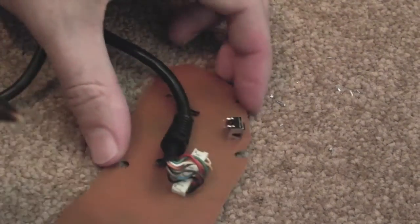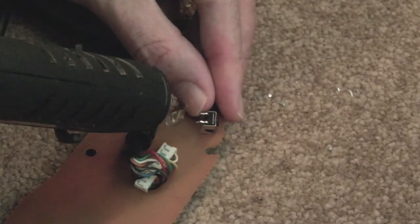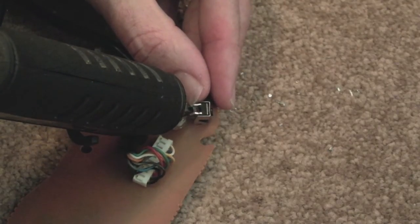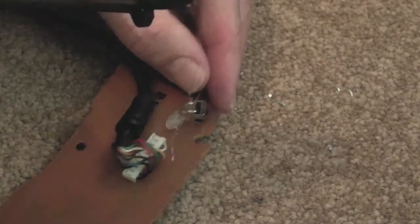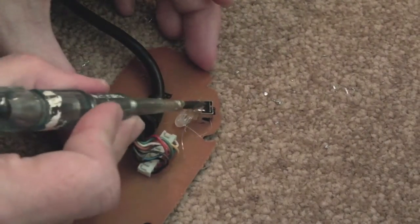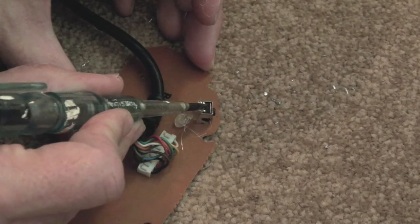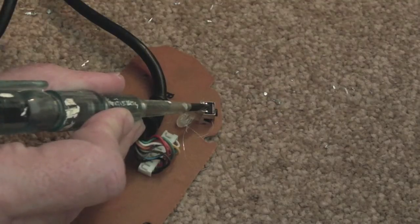So this is the board with the replaced micro switch. What I'm going to do is push the switch forward a little bit, because normally it's held by the metal bracket which is actually part of the switch. Just to give it a bit of extra support, I'm going to push it into position as far as it'll go and put some hot melt glue in there. I'll just hold it in position using a flat blade while it dries — it takes several seconds at least to dry. It just gives it a bit of extra support to stop it from becoming a fault in future.